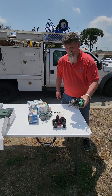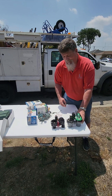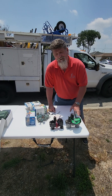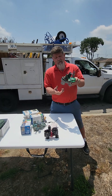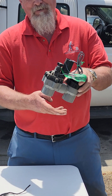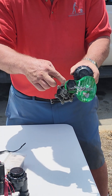When a plastic valve fails, your only recourse is to go buy another valve, which is exactly what I did in this case. The thing is, you have to buy the exact same valve — the parts will not work between different models. I cannot swap out parts between these two valves; I have to get the exact same Rainbird valve. This valve was leaking and I couldn't easily get the plumbing off of it.